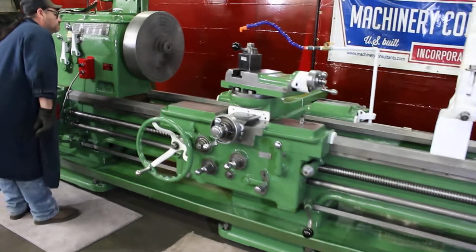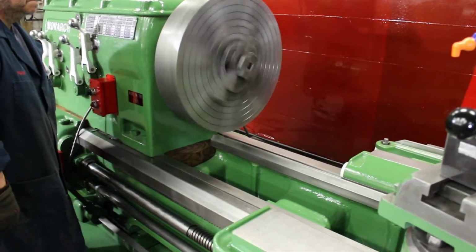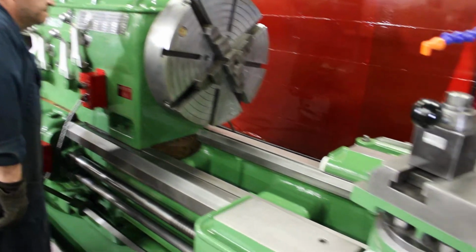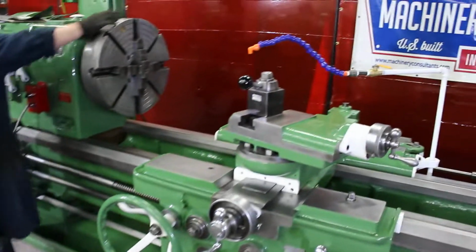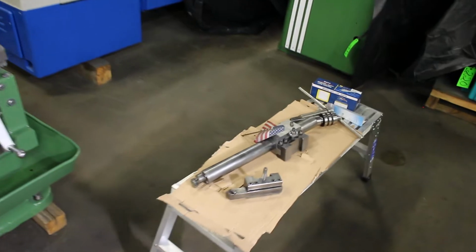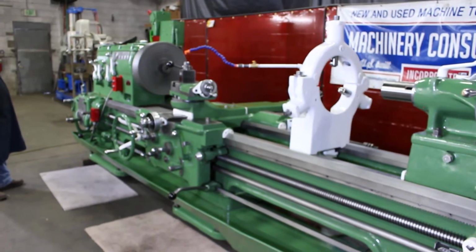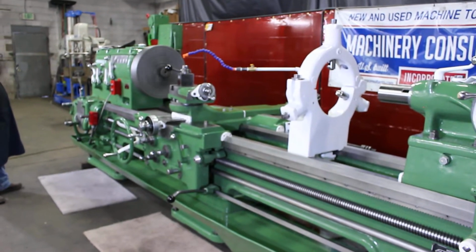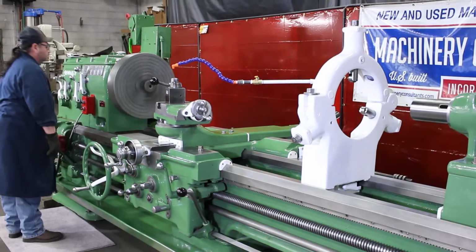We're spinning a heavy pattern American-made 21-inch four-jaw Cushman. Nice 400 RPM, Frank. Aloris CA post, very nice brake, a smattering of miscellaneous tool holders. Very nice tool holders. A 2-inch diameter boring bar. That's a nice 500 RPM.